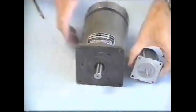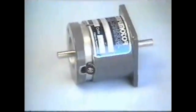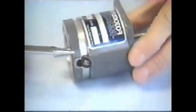To show how a step motor is constructed, we'll take a 5751 apart. Most of the things we'll do in disassembly actually destroy the motor. First, we pry off the epoxied back cap. Just cutting the motor cable short like this is enough to destroy the motor because the cable wires are integral to the winding. Cut them this short and the motor must be rebuilt.